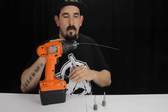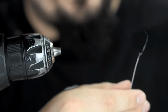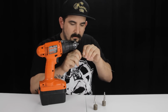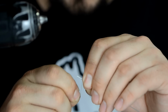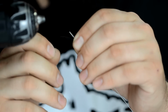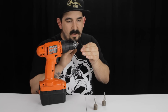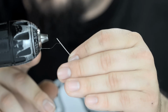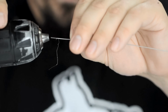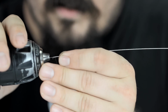All right, so after completing the wire, I take it out of the drill, and on the end, the lead that I left long, I start and manually remove this wire. This just gets that lead away from the lead that's staying, so it doesn't catch it. Then once I have a little bit there, I'm going to reinsert it into my drill, and by flipping the wire 180 degrees, you can still leave your drill in the same direction. When I go to mount this, I'm mounting not only the 26 gauge, but I'm also going to clamp down on the 36 gauge that's staying.